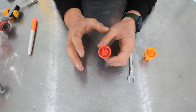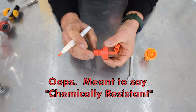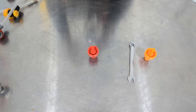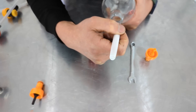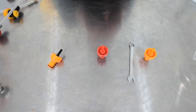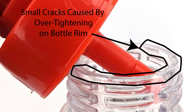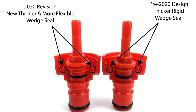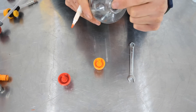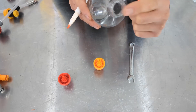When we first brought out the earlier models, this wedge seal was quite strong and thick. We make these out of a polyketone substance, so all the plastic is highly chemically resistant and very robust. But we found that the little wedge seal — that little fin that seals on the neck of the PET bottle, sealing on the inside edge — meant that if people over-tightened the earlier models, they could potentially damage the neck of the PET bottle. So in the next variation we started to make this fin thinner and thinner, so it wouldn't put as much pressure on the internal diameter of the neck, meaning PET bottles — especially weaker ones not designed for reuse — would last a lot longer.